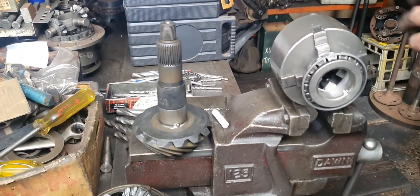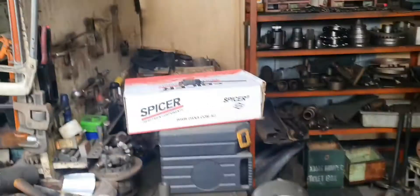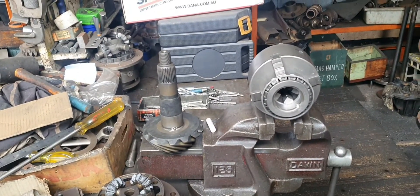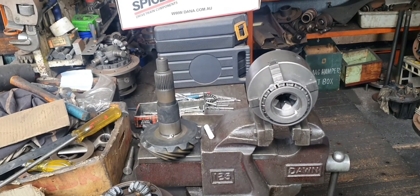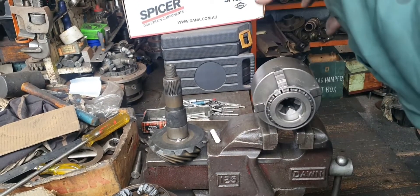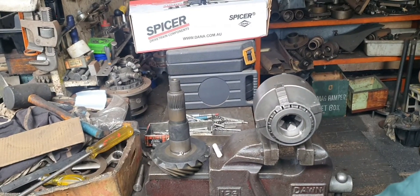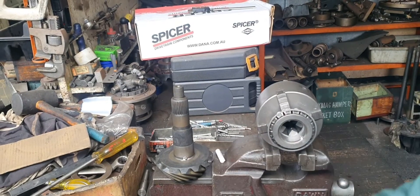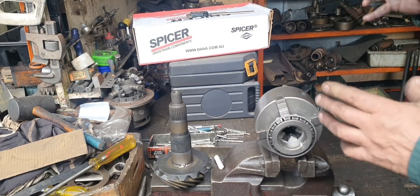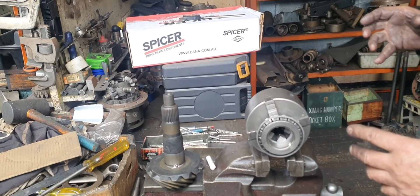They all made it faulty, this stuff. What American ship is that? Early Chevs — those 1960-odd year Chevs were like that. They had a washer underneath there to set the pinion depth. And they used to gradually scoot around, because there was only about three-quarters of a thou interference fit from new. Then they'd wear a 10 or 15 thou step in the washer, and the bearings would be loose, and they'd have a lousy outer mesh mark.